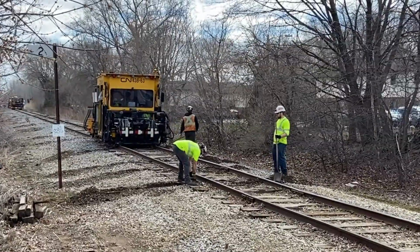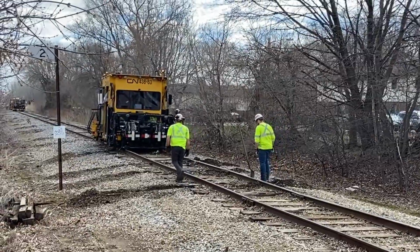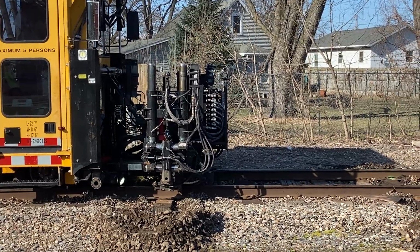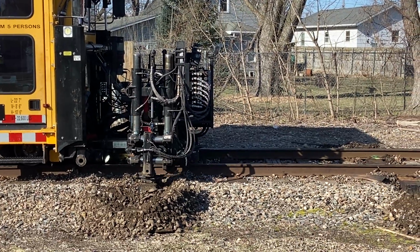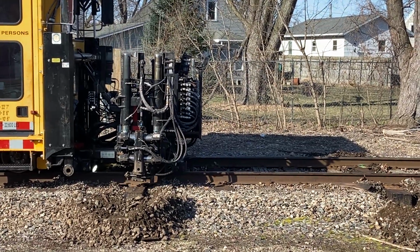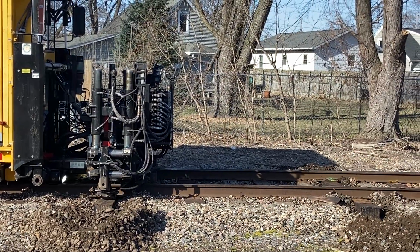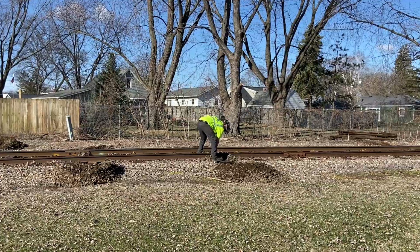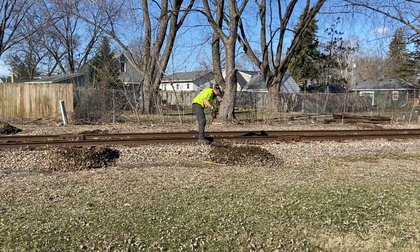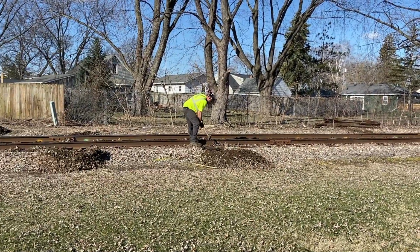The ties have to be clean of rocks or other material, where the tie plate will sit on it. The next machine raises the rail enough to slide the plate in place under the rail. This rail line had smaller sized rail, hence smaller tie plates than the machine was designed to handle. So because the plater couldn't push them in far enough under the rail, a worker had to follow the machine and hit them in the rest of the way.